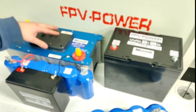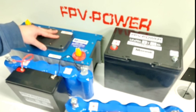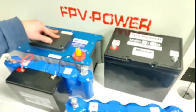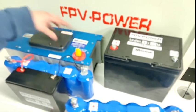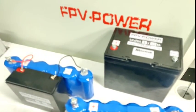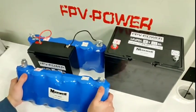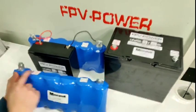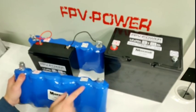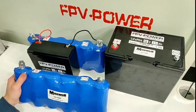And when they exceed individual cell, I forgot to say, they are 2.7 volts maximum. So 2.7 is 16, to be exact, 16.2 is going to be 16, round down. So, and this will monitor. So when we actually disassemble the caps to get these, which is a tedious job, gotta be very careful. And the bus bars connecting are all laser welded. And they're aluminium, and they're very easily broken as well if you're not careful.